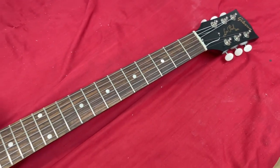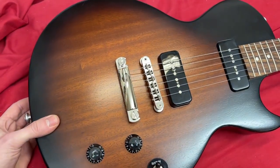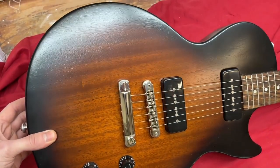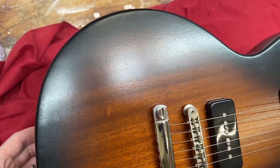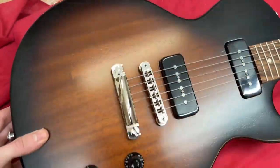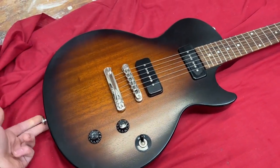The owner would like a TV yellow finish, so that's what we're going to do. To do that, we need to take the old finish off first. If you're going just a solid colour, you could technically leave this old finish on there — I personally wouldn't, but you can. But we're going for the TV yellow, so we need to get these pores really exposed, even more than they already are, so the grain filler will stick in that.